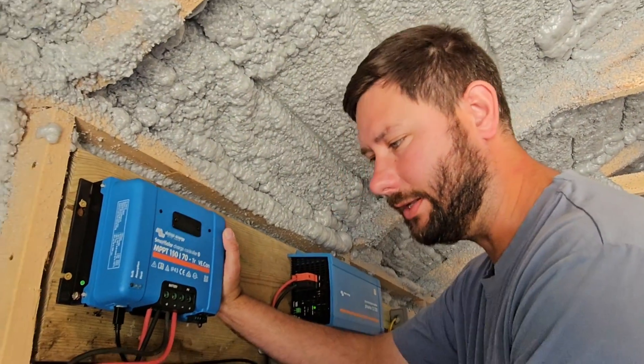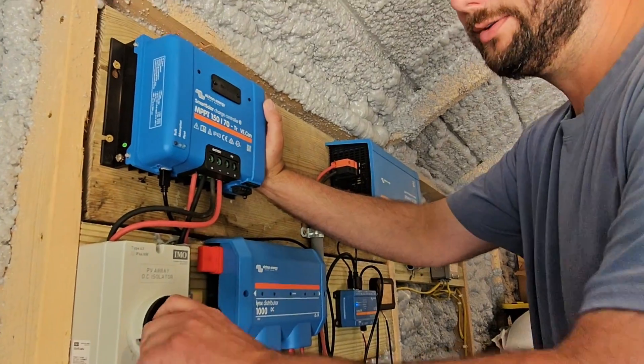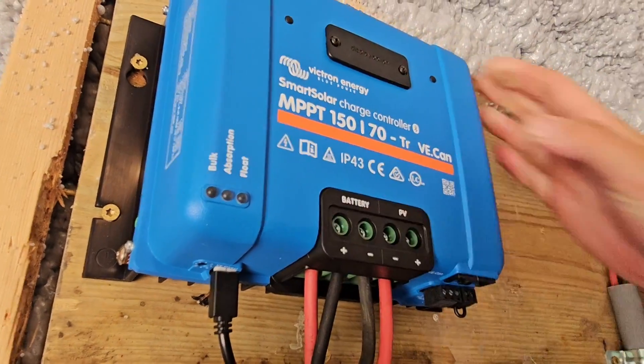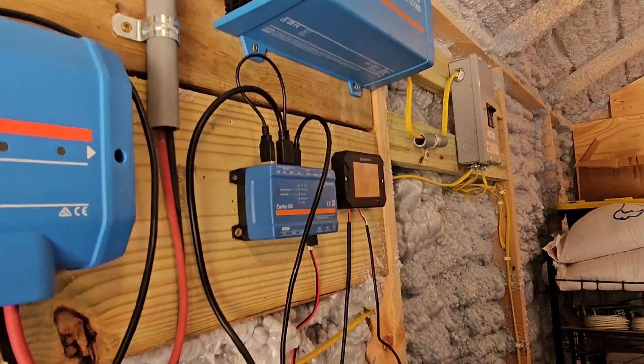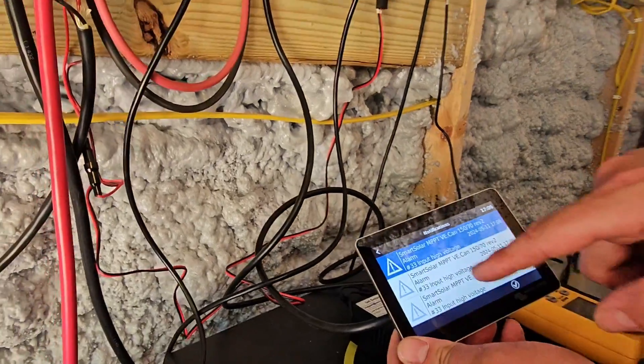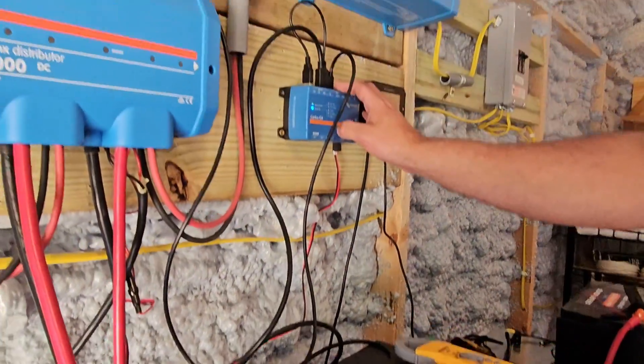Now that we've got the wires connected, we're going to allow the PV power to come to the charge controller by switching on that disconnect. I've also got the VE direct cable connected at the VE port on the charge controller and then connected to the Cerbo GX so that I can monitor the device. Right here I have displayed information — it looks like we've got a number 33 error, and that's input high voltage. I can see that by using the Cerbo GX. It's a great thing I have it, because as soon as I plugged in the VE direct cable it was able to monitor and tell me the voltage is high.